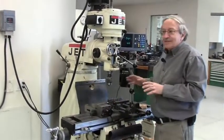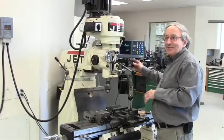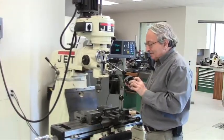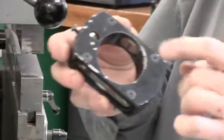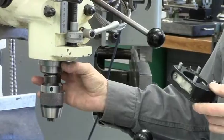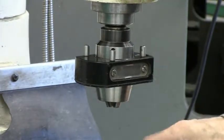A very, very useful accessory for a machine like this, which unfortunately you can't buy — don't ask me why — is some kind of a laser center finder. All it is is a head from a laser pointer, with the lens moved a little bit to focus about here, and a battery. It's designed to clip on the chuck, or clip straight on the shank in case you use collets.